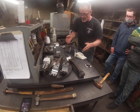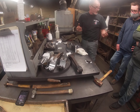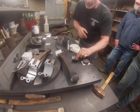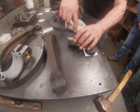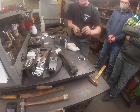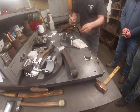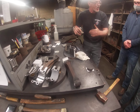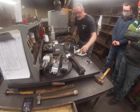I'll clean it up, knock all the mud out of it, put it all back together nice and clean, and then it's going to go to the mill for machining and then for sonic check, and then back to the mill. Because we took the liners out and the original babbitt ones didn't have a groove with a through hole in the orifices. So we rough it first, then I'll come back and we'll put the groove in and chase these holes that are in this cap for the oil to go through to feed it — at about a 20-degree angle, 93 thousandths through hole. We'll chase that all back down there, make it nice and ready, and clean it all up.